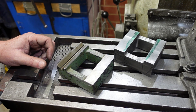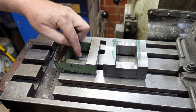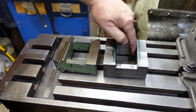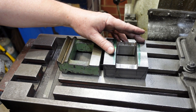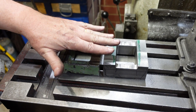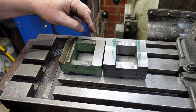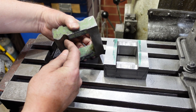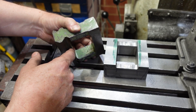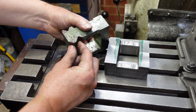I'm at a halfway-ish spot at the moment. I've taken the block down to size, put in these reliefs, and cleaned up the inside, putting a one-degree taper on it. That actually gets me very close to what you'd get from a casting — possibly a little bit taller on some surfaces to give more machining allowance, but it's pretty much what you'd get. The next thing I'm going to tackle is putting these grooves in — they're not critical, they're just a clearance groove — but I'll put them in just so that they're there. Once they're done I can start thinking about putting in that V and that V.